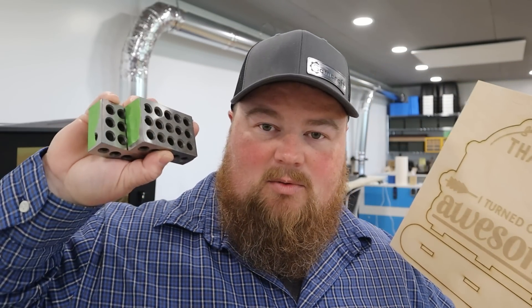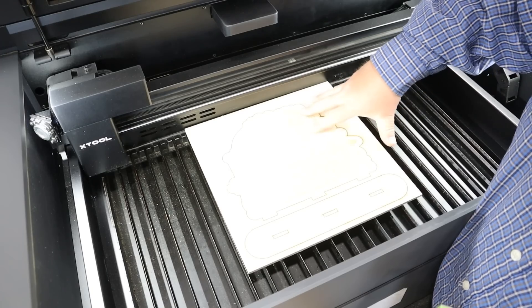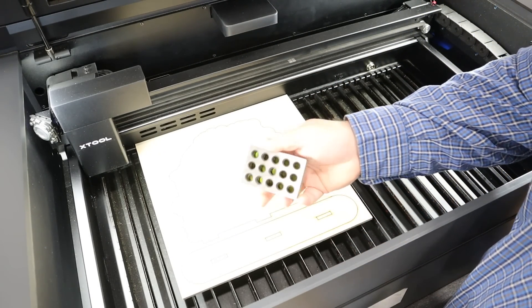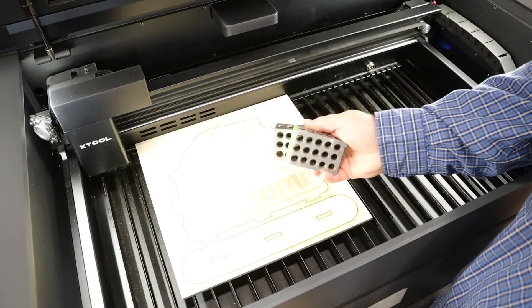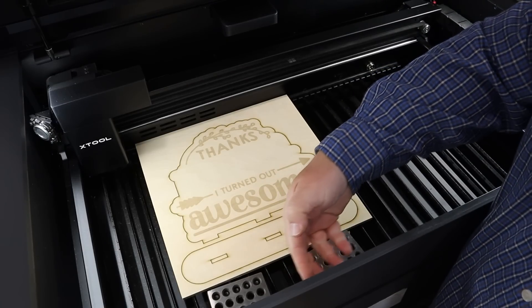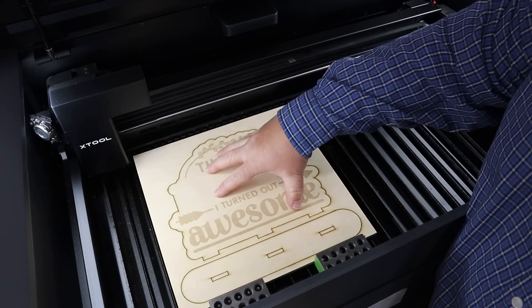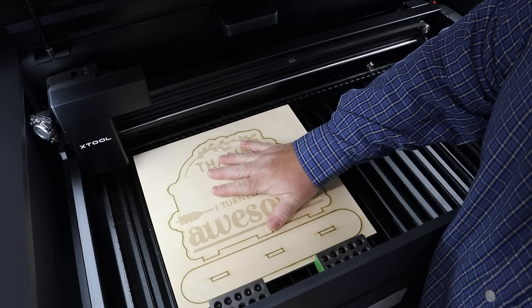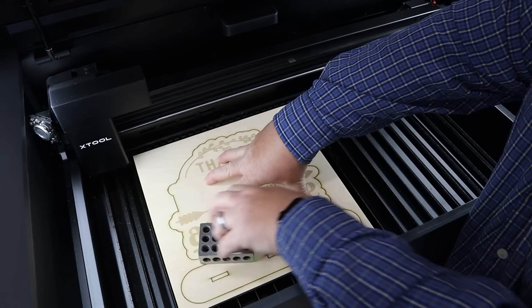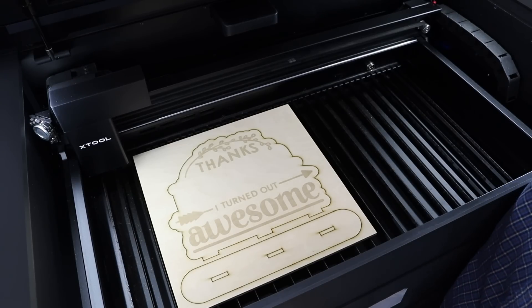If any other machine were being used with no fixture or jig system, this would just be a piece of firewood. But I'm going to use the power of the P2 with its dual cameras — specifically that close-up camera — and rerun this job. I'll put the piece back in using the same one-two-three machinist blocks I always use to get it parallel with the case. I'm going to intentionally place it off-center to show what the cameras can do. Machinist blocks pushed against the front edge, piece pulled forward to square it up, then carefully remove the blocks. Now let's go back to the software.